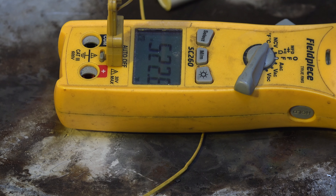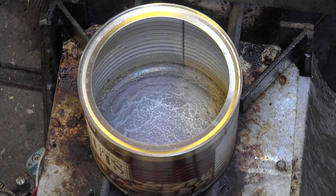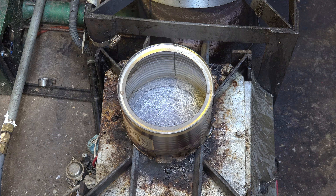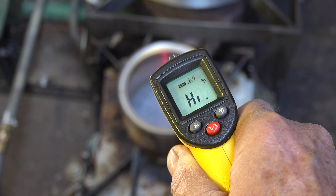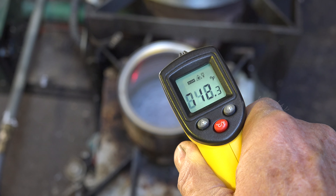After a few minutes you can see it's burned up most of the label. The bottom of the can is probably getting pretty close to red hot. Once that water is boiled out, the heat cannot be absorbed by latent heat — the only thing left is that it can increase its temperature. Checking with the non-contact probe, I'm showing in excess of 750 degrees — this thermometer doesn't go above 750.